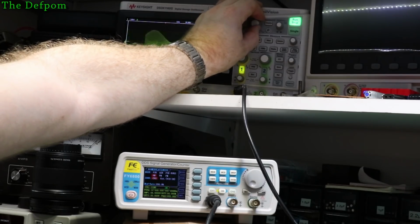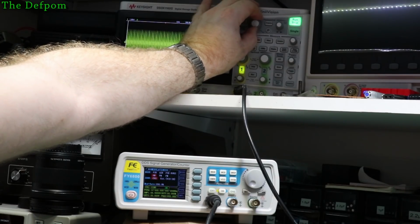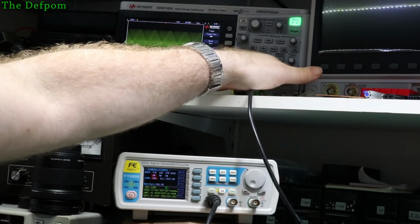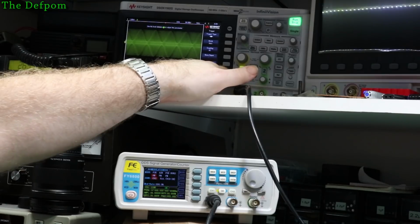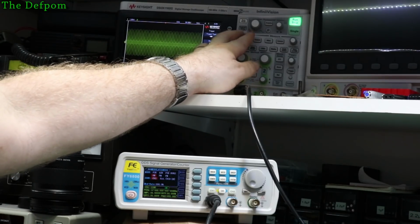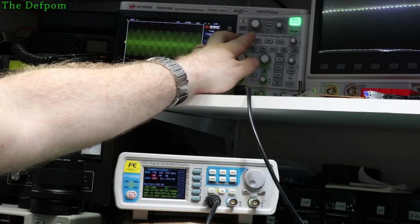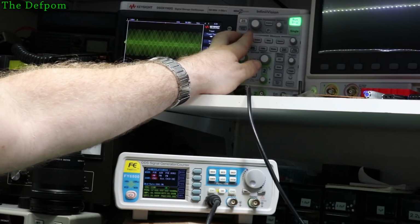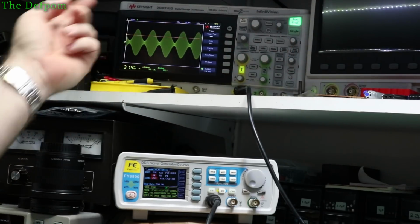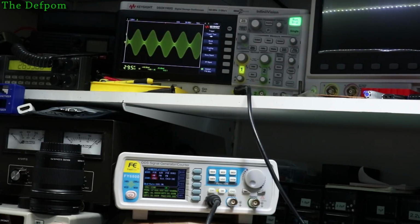1 megahertz. So let's just bring this down and try and get that to actually lock on there. Just to adjust my triggering. Just to hold off, I should be able to get it to lock on if my trigger position's in the right place. There we go. Alright, so there's the waveform there. Alright, AM waveform. So as you can see, it's coming out okay.